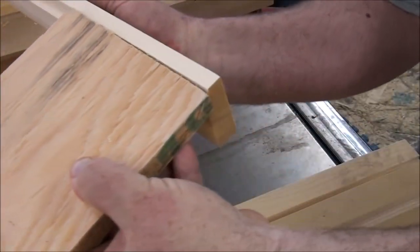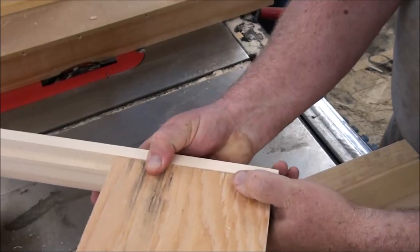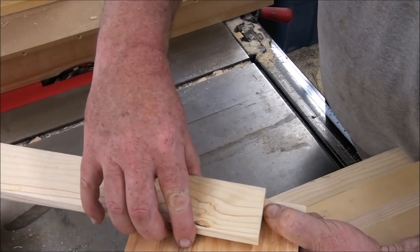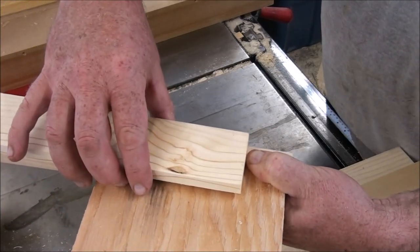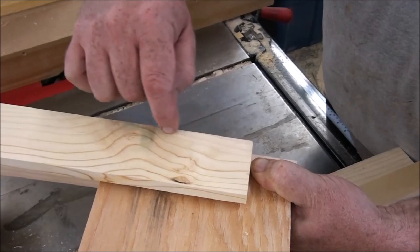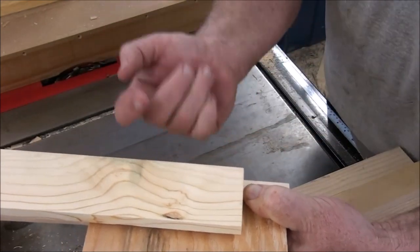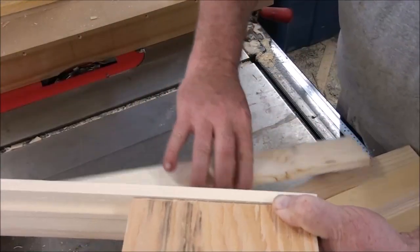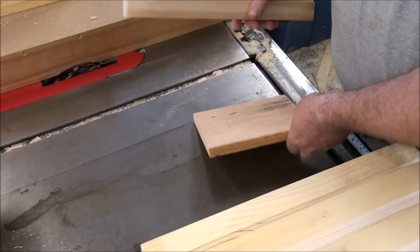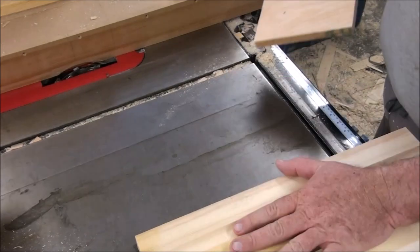The top cleat will glue and screw — and nail actually — that thing's really secured tightly. I nail it through here into the end cleat, glue underneath the whole thing, and then screw it underneath through the plywood to pull it tight down onto there. I'd like to clamp it, but I can't clamp it — I'm building 200 covers and I don't have that many clamps, probably not enough for maybe two or three covers.